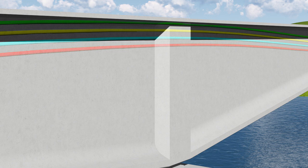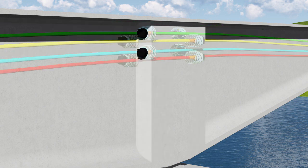A primary detail to be developed when using laced tendons is the haunched girder's web stiffener. Full-length tendons require web stiffeners sized to stabilize and strengthen the web as vertical reactions are transferred to the bearings. When laced tendons are used, the web stiffeners must also be designed to accommodate tendon anchorages. The length of the web stiffeners must be increased in order to develop the horizontal deviations of the tendons from the centerline of the webs to anchorage locations in the web stiffeners.